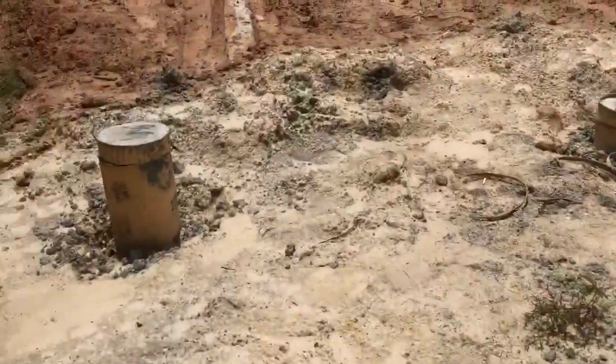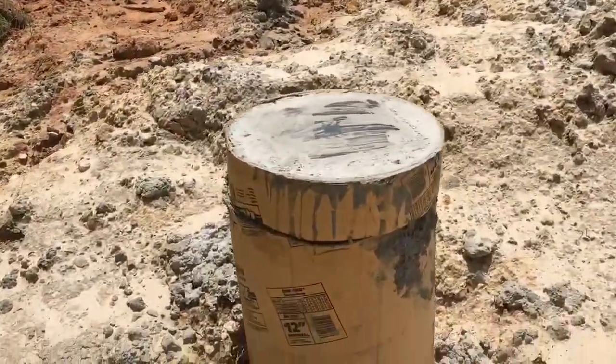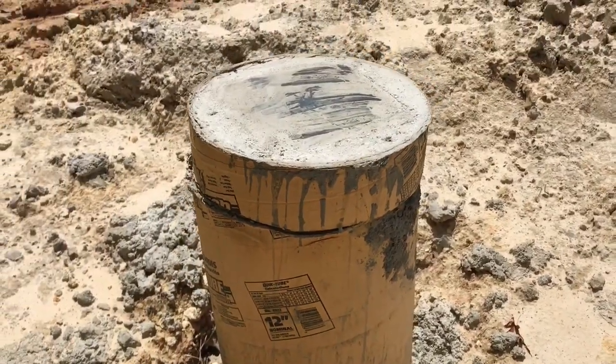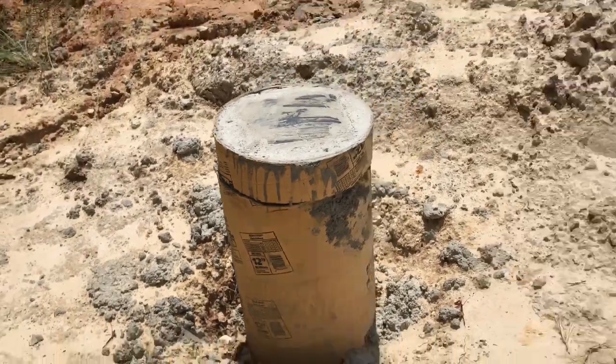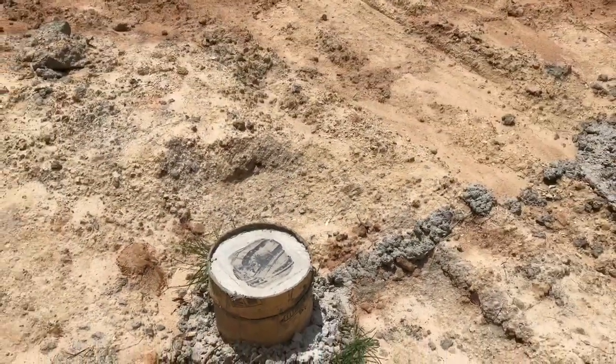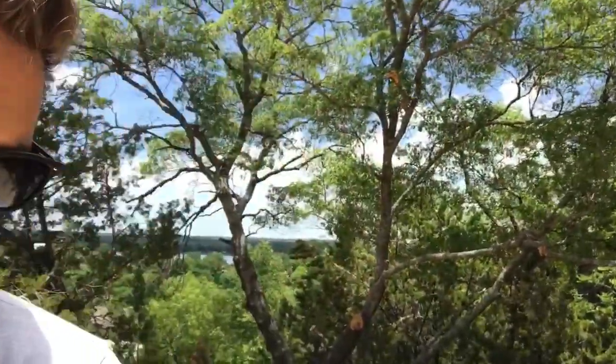And then over here, it would appear as though they poured the thing about 3 inches too short. And so they packed on something there, and this one as well. So yeah, I'd say there's probably an uncomfortable conversation coming, and it's also probably why I haven't received a bill yet. I do need to put something on them and double check that it actually is level, that the elevation on these piers right here is the same as the elevation on those, so I probably need to shoot those and make sure we're good there.